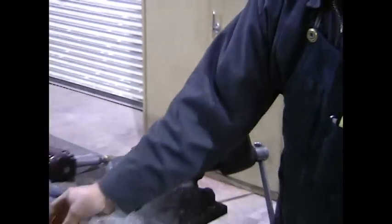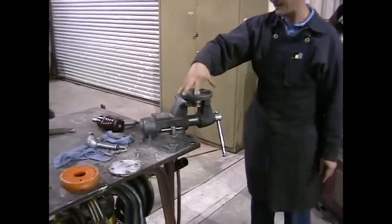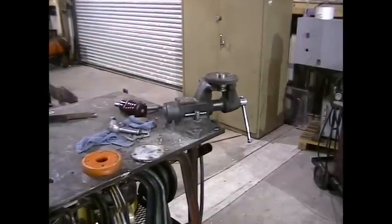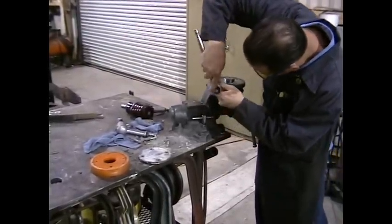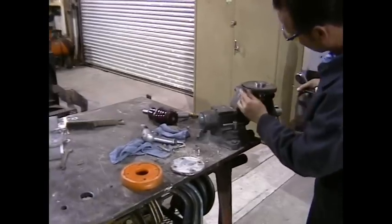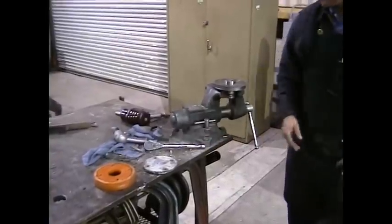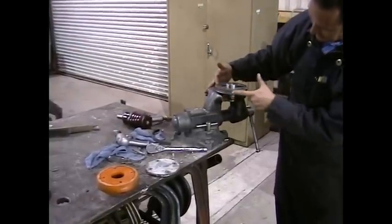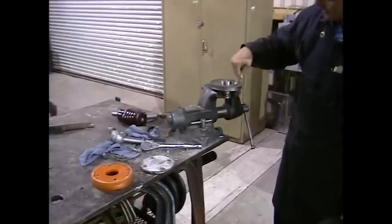There's our piston and piston plate. This side is called the concrete piston adapter. To disassemble it, sometimes you can find the groove because it is a split ring. During our cleaning process, we want to check a few things — we need to make sure this groove is nice and clean, and clean off all of the concrete. It's also a good idea to run a tap through your holes. This is a three-eighths fine thread.